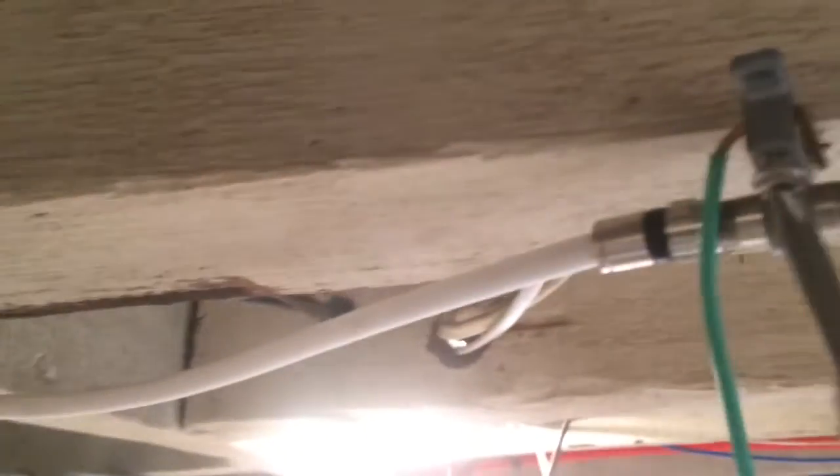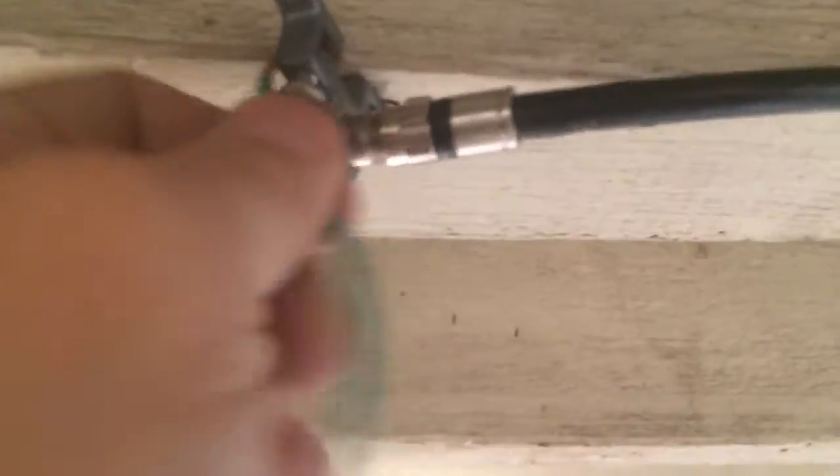So the proper way to do this is this has got to go away. This has got to come out. A new wire is going to go in, but it really needs to be grounded to the main electrical service. This wire here is what it's going to be.